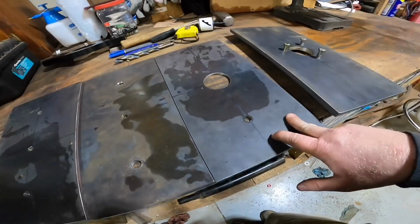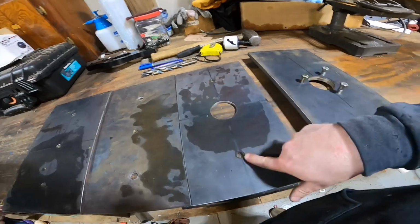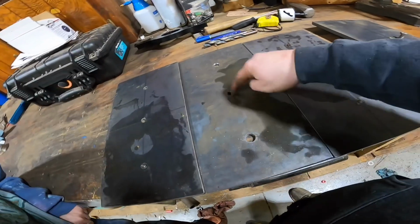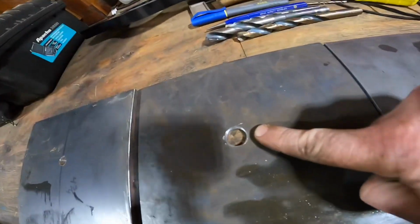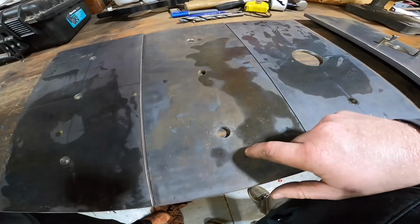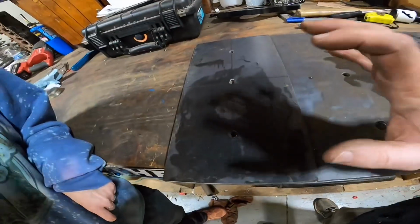This will be the next plate, what I would refer to as the middle plate. The jack obviously will come through here. This will be the 2 support rods. This will be the plate that sits on top of the jack, where this bolt hole will bolt directly to the foot of the jack. And I wasn't able to get these 2 holes drilled out right here. Those are only drilled out to a 5/8. They need to be a 1 inch hole. That way this plate can slide up and down on the support tubes. And then this is the top plate. It's got 3 1/2 inch holes.